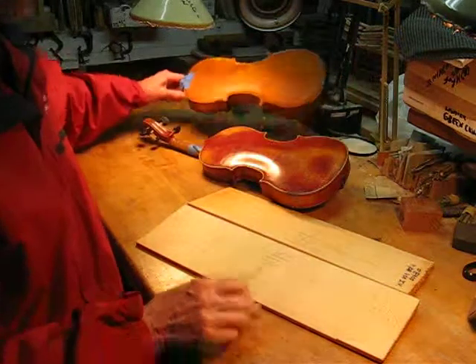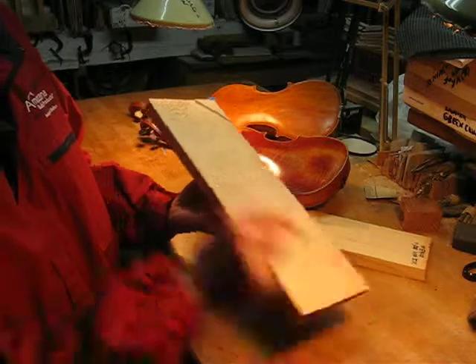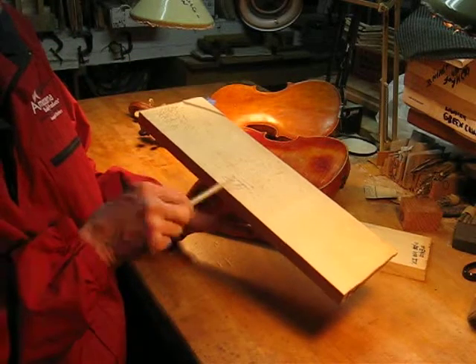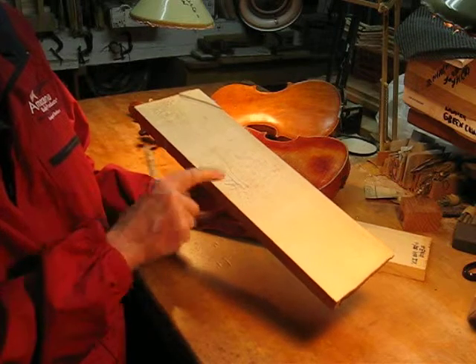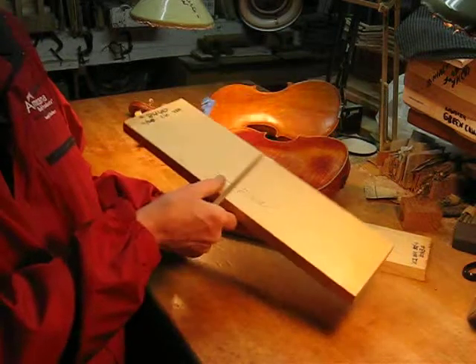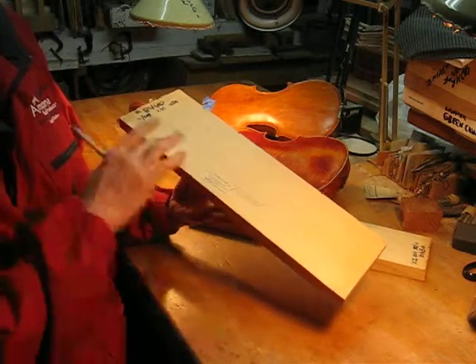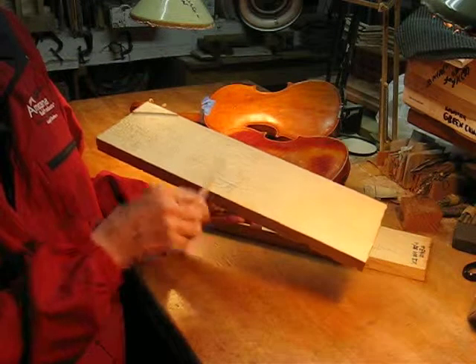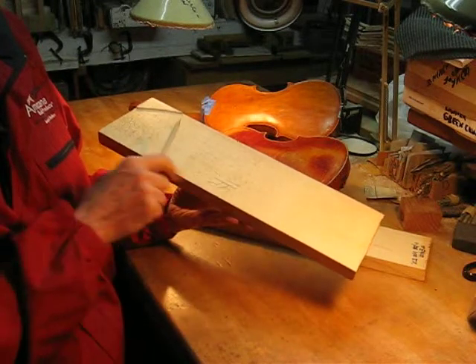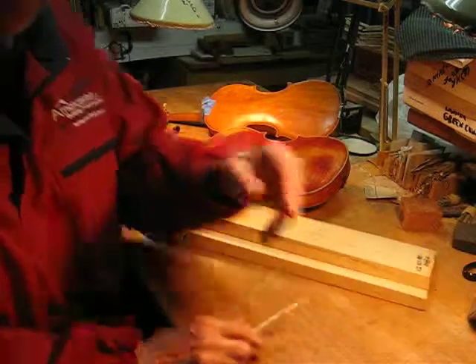So that's the tip of the day in selecting your wood. See if there is grain runout — you do that by having a consistent shape and just tapping along. If it's brighter in the middle and not as bright on the ends, that side goes up. If it's high on the ends and low in the middle, mark it down. Orient both pieces with the bright center facing up, and you'll make a better instrument. Thank you.